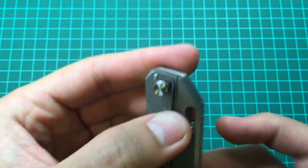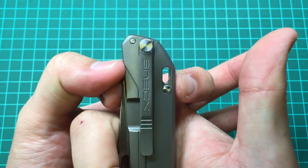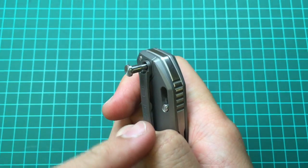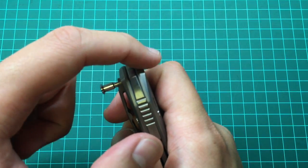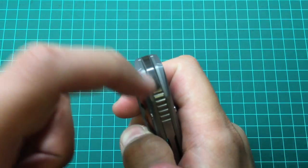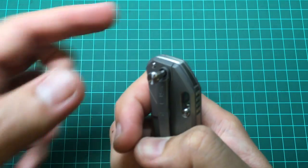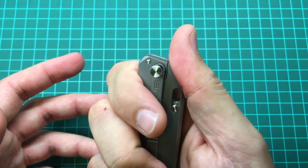That's the safety pin. So one trick is you make sure you pinch top half and bottom together to make sure all the holes are lined up, because we have this pocket clip, 2 parts, the back spacer, another 2 parts. So we have 1, 2, 3, 4, 5, 6. We have 6 parts that will go through by a single pin. So the tolerance and the fitting, the holes must be aligned exactly.